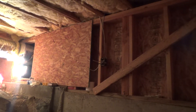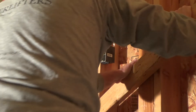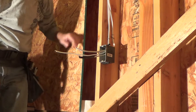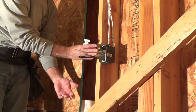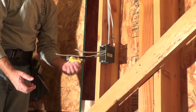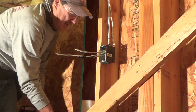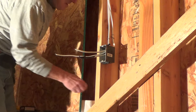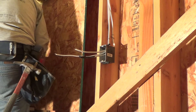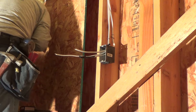I'm going to try to stay out of your way as best I can. I could have made this just a junction box - connected all the blacks together, all the whites together, all the grounds together, put a blank plate on there as my junction box. But instead of just doing that, it's going to be a junction box as well as an electrical outlet. Since I have the power there, why not put an electrical outlet there?